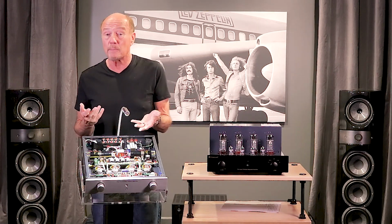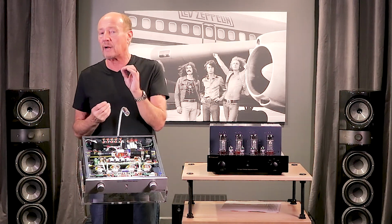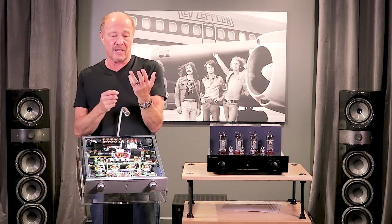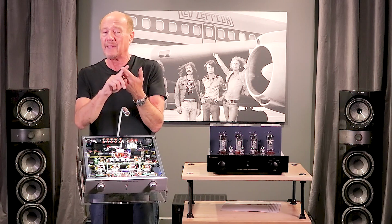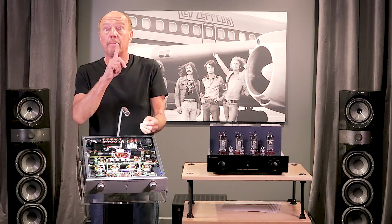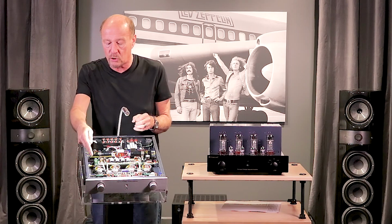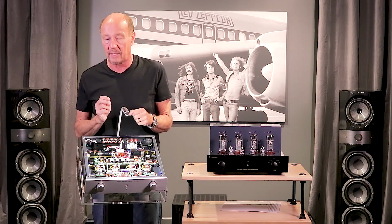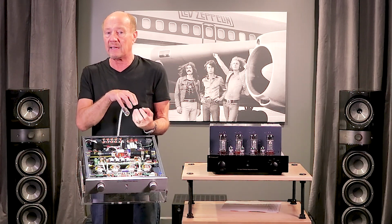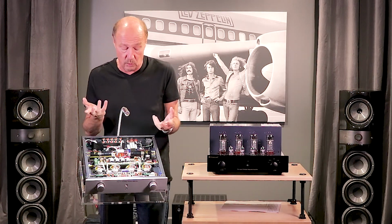In fact, that doesn't even have to be the right tube. Adaptive auto bias is so smart, you can run 4 different power tubes at once. We've done it at shows. We've put in a 6L6, EL34, KT120, and a KT150, and it will make them all play nicely in the sandbox together. But to make sure that the performance is the best it can be, there's a tube selector switch on the side. The EL34 setting is for smaller dissipation tubes. KT88, KT120 setting is for all the larger tubes, all the way up to KT150s.